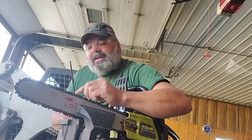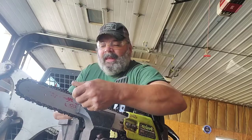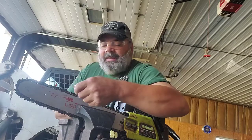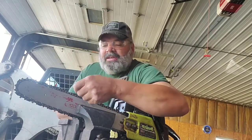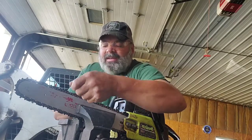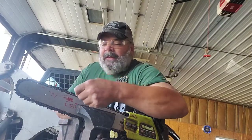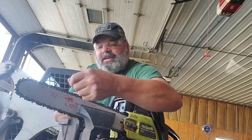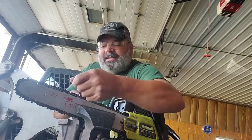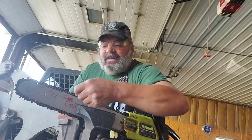These teeth, they're about gone. He's gonna have to invest in some new chains here pretty quick. A couple of them I'm going to tell him — they're so small that you get into some good hard wood and they are gonna break. I took them out back and tested them in some maple that I got out back, but you get into some hard oak, or something stringy like cottonwood or sycamore, and you'll start snapping teeth off — that's how small they are.